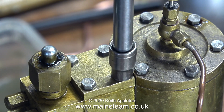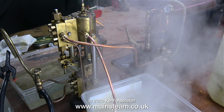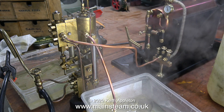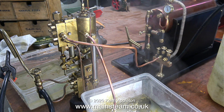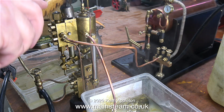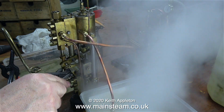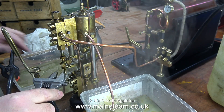I'm refitting the top cap of the shuttle piston block and I'm going to try it on steam one more time. Opening the valve on the boiler, the main piston rod starts to ascend — this is encouraging because it didn't do that before. Previously the shuttle valve was stuck at the bottom of the cylinder; now because the piston is at the top, the shuttle valve is stuck at the top of the shuttle valve cylinder. A gentle tap with the hammer does nothing. Tapping the slide valve with my spanner makes steam come out of the exhaust pipe but there's not much movement in the pump itself.